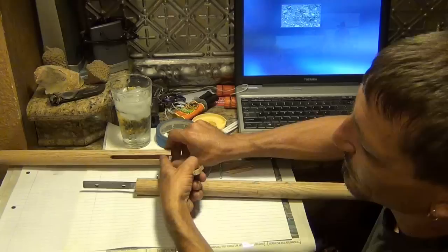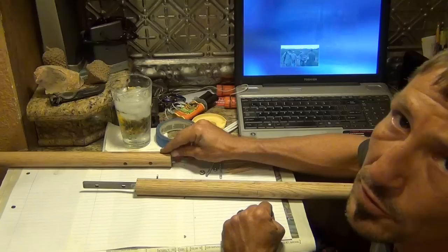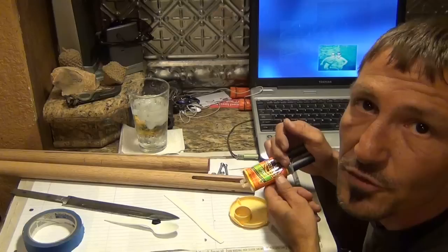After I set my handle in, that'll fit down in here and close it up. There's a little bit of a discrepancy here in depth, and this is so that I can get some epoxy behind it to help glue this piece in and also to help solidify the haft as it sets. I just happen to have Gorilla Epoxy because that's what was laying around — that's what I grabbed the last time.